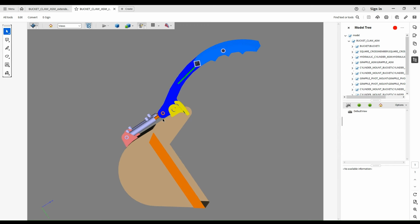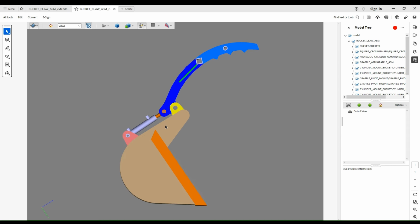So one last option I want to talk through if you're doing this yourself is you can do this whole thing with cardboard. You don't have to have CAD. The metal fabrication shop that I worked with, they've told me in the past, hey, if you need something cut out and you don't want to go through the process of getting that into CAD and creating files for it, just bring in cardboard templates. We'll measure it, and we'll basically draw it up in our system. Now, you're kind of trading your time for their time. But if you've got a cardboard template, it's actually pretty quick to still draw up in their software.